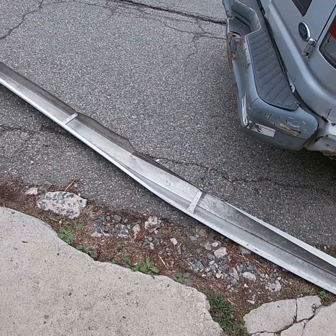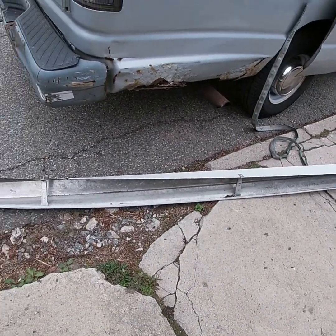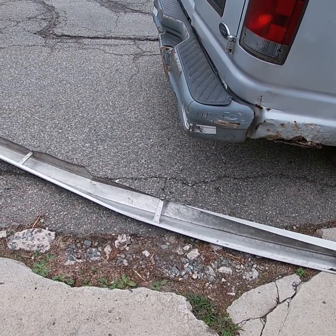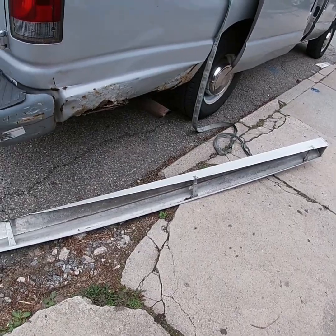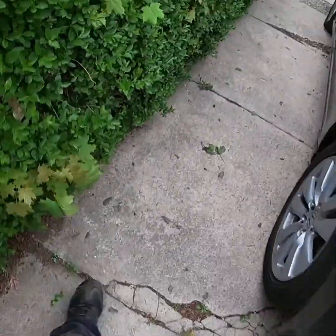So with the piece that we're doing, we're going to be putting up 50% more straps to give it the security and rigidness that the gutter needs to be able to withstand the ice and snow that we get in the Northeast. So over here we got the pieces already put together.